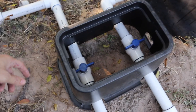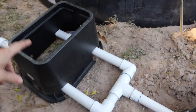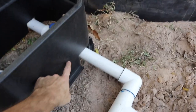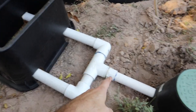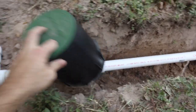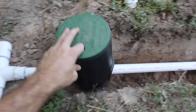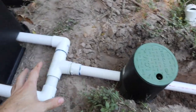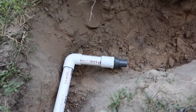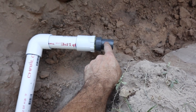We've got our modified box with our valves in it, and this U-shape will allow some movement — the box shouldn't impede it too much, I might make these a little bit wider. They tee off and go to a one-and-a-quarter-inch, and I put another valve so I could shut the system off at that point as well. It's always good to have a lot of shutoffs in case you need to do maintenance on certain parts of the system. Over here we've transitioned to one of those poly pipe barbed connectors, and we are going to be connecting the poly pipes.